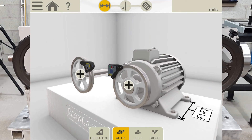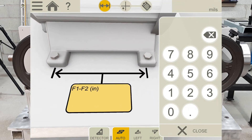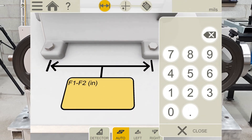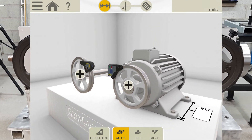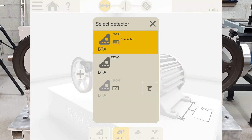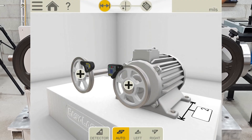To enter the distance between the motor's feet, we tap the area that says F1 to F2. F1 is the front foot and F2 is the back foot. The adjustment distance is 2 inches on this demo rig. Before moving on, I can tap the detector button to make sure I'm actually connected to the detector — which I am. By tapping on the next measurement icon, you will see a live-time result of the misalignment in a 3D image.